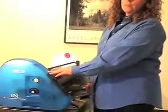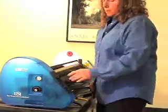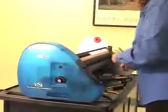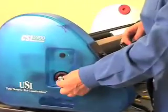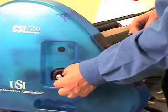In order to change your heat power switch, you will need to remove the left side housing. As you're standing in front of the machine, it's on the left side. Before you remove the housing, you will need to remove the thermometer and the small temperature knob, which has a small Allen wrench set screw, which is metric.